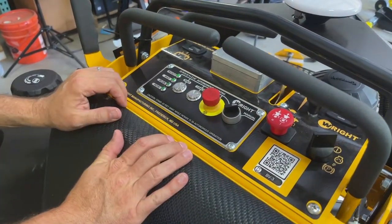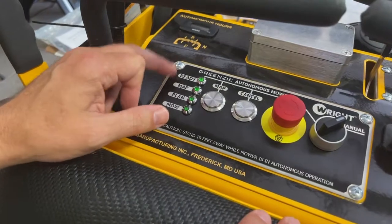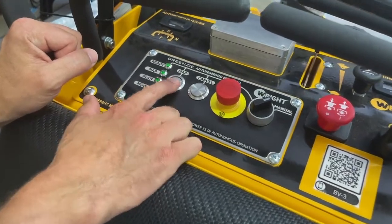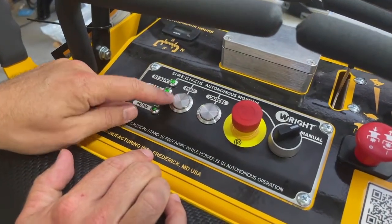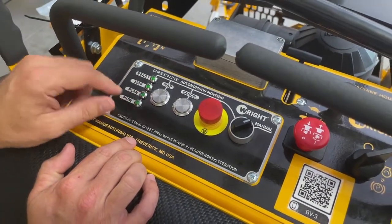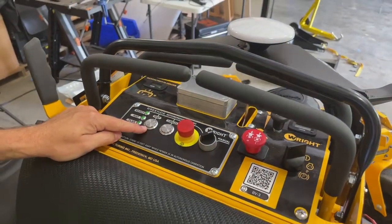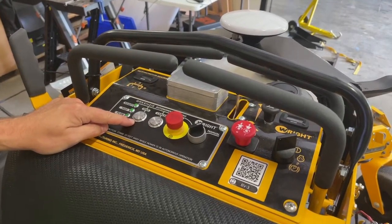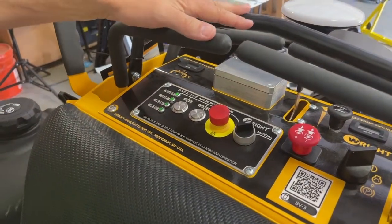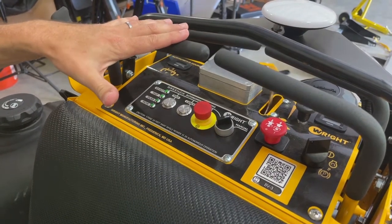When you're ready to go to autonomous mowing, it's very easy. The system will tell you when it's ready, and most of the time it takes about 60 seconds — so by the time you get it off the truck and out into the field, it's ready to go. You press this map button. It's a standard latching button with a nice feel to it, waterproof, IP66. You can pressure wash it if you need to. This sends a command signal to our software through a microcontroller, which means it's lightning fast, and then a serial connection is read to send the map command. Our system then begins reading all the sensors to record where it is. For more on that, check our other video on how the robot knows where it is and draws the map.